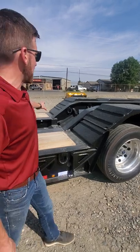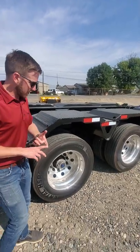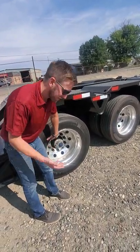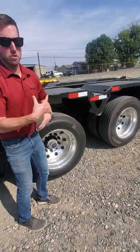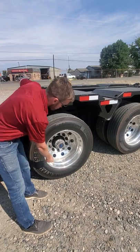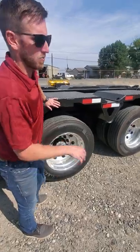Back to the rear of the trailer, we have our six-foot knuckle trough, our boom plates, which are removable if you need to get to the top side of the axles and the air chambers. As far as maintenance goes, just like any wheeled piece of machinery, you want to check your lug nut torque after 500 miles or sooner. Check your oil — as that oil has been lubricating all the new components, you want to make sure fluid levels are good. You can pull these Stemco caps off to check the oil level and drain as needed.